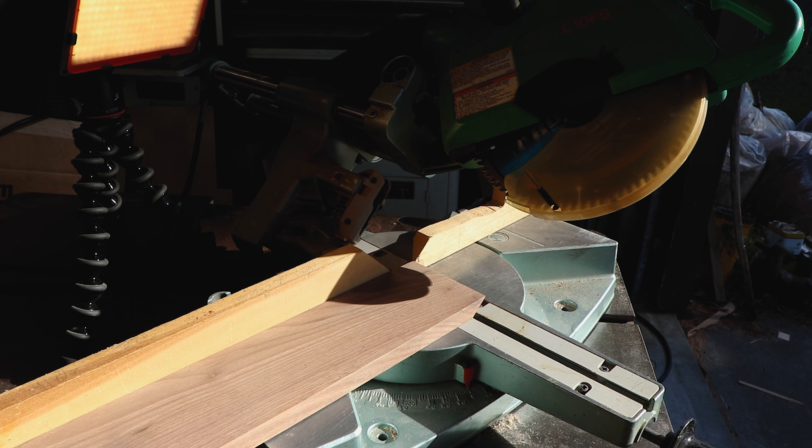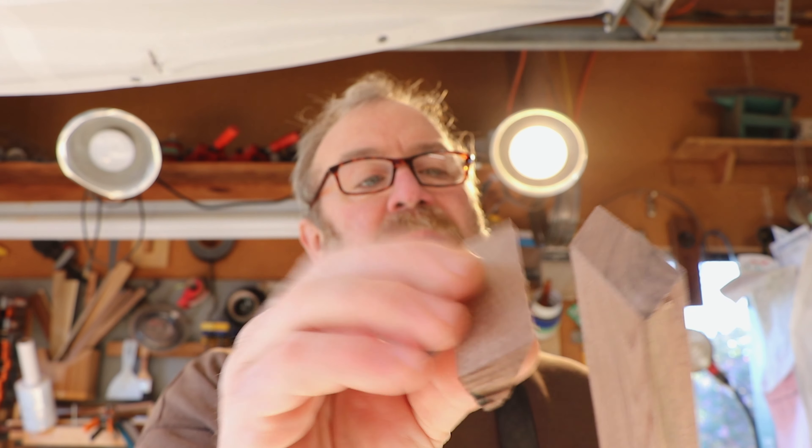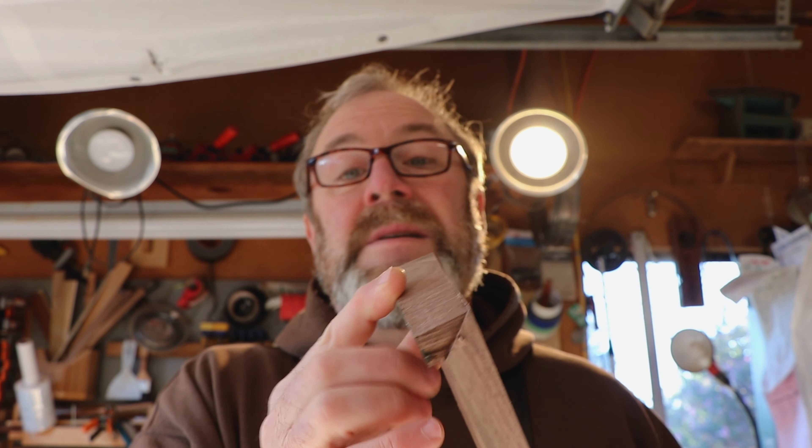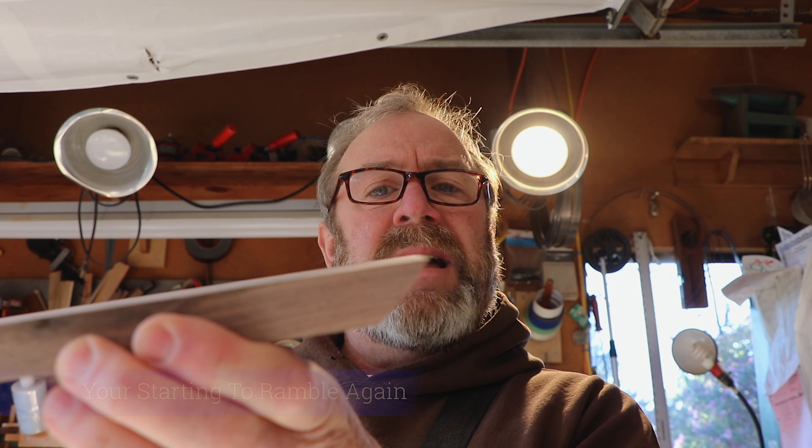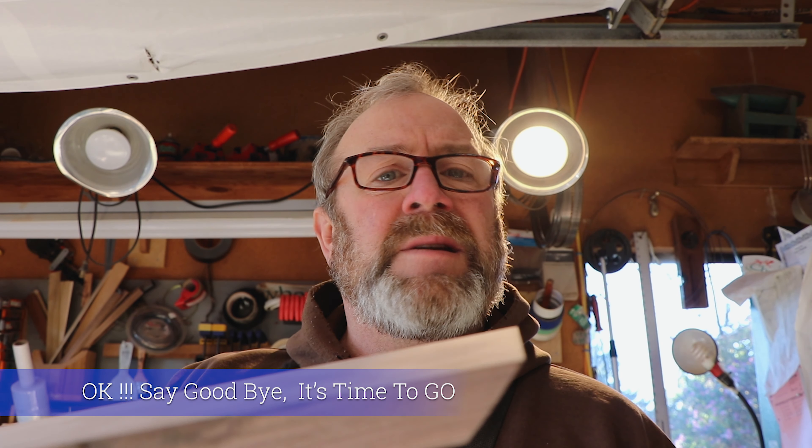Anyway, once it's all cut and you've got a piece mitered, to save your tips so you don't ding them up — take the leftover little cutoff pieces, put them on the ends, and tape them. Tape is your friend. Just tape a piece of wood on there and it'll keep it from getting dinged up too much. Then before you stain it, take it off, stain it, seal it, topcoat it, put the piece back on for shipment. Because if you leave it sharp and pointy, it's liable to get hit and damaged, and when you put it back on your cabinet it'll look ugly.